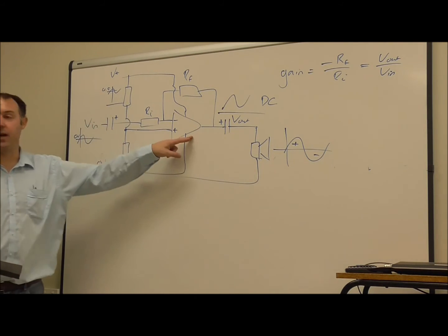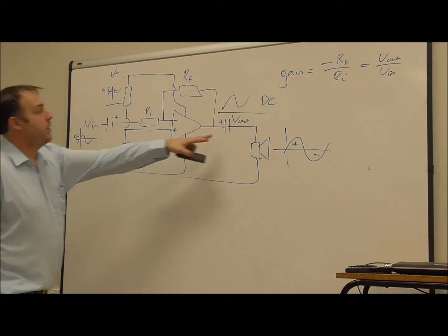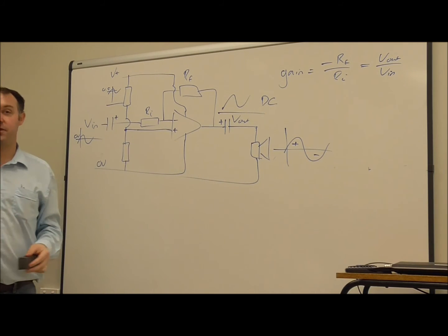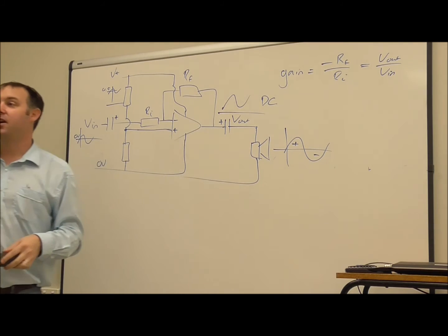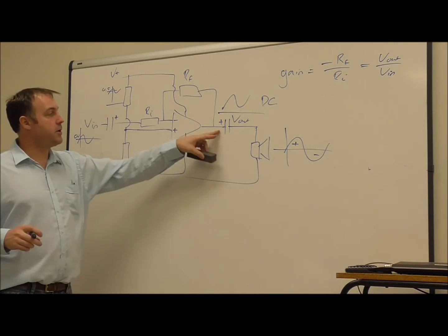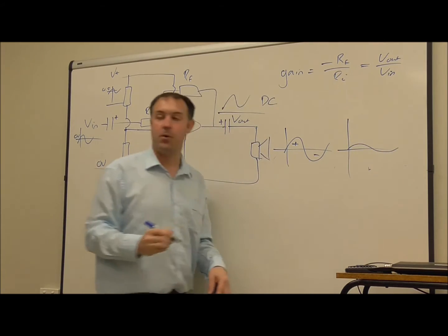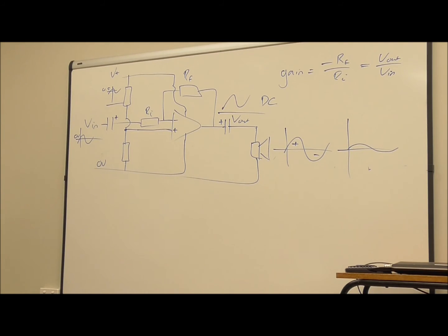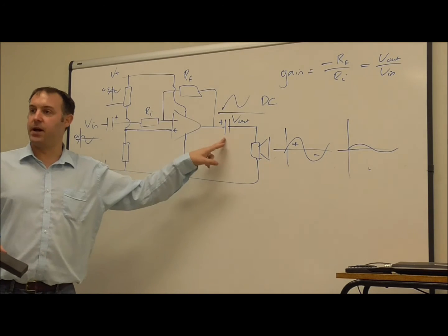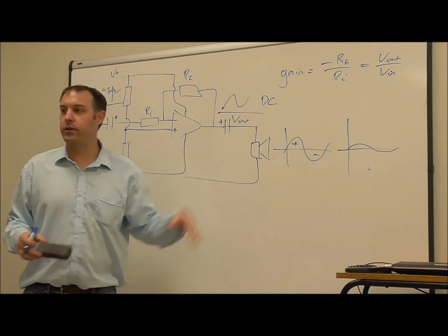With the positive terminal of the capacitor towards the amplifier - towards the positive biased voltage. Now this output capacitor, depending on what the amplifier is capable of outputting, if it's capable of outputting quite a lot of current, we do need a reasonably large capacitor there. Because the amount of current into the capacitor determines how quickly the voltage can change. If we don't have a large enough capacitor, instead of having a full-size signal, we get a smaller signal because the capacitor charges up and takes away some of the voltage across the speaker, effectively filtering out the signal.